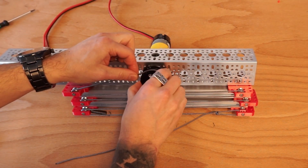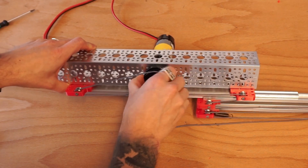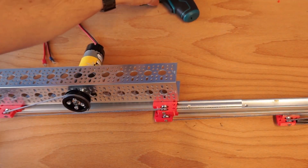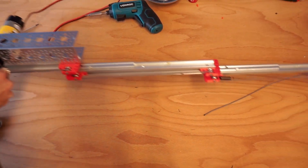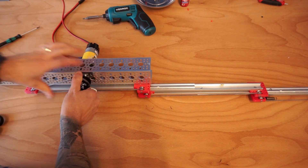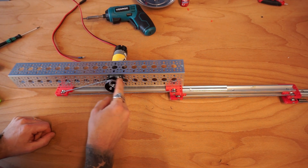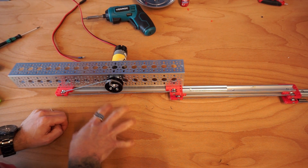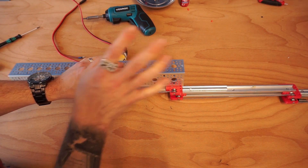This should be a pretty good system. If we were to keep rotating the string and actually fill up the motor you're going to notice it's going to extend our whole system. At this point we actually do want to extend the whole system to max, so I'm going to keep twisting this and rotating until I get to my max tension — really cranking on it to get to full extension. Now it's time to start doing the retraction string. Because our extension string loops up this way, we actually need our retraction string to loop up the opposite direction; otherwise you'll be trying to retract and extend at the same time.